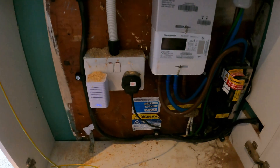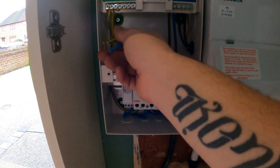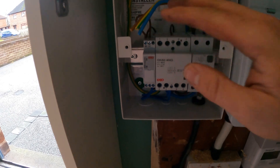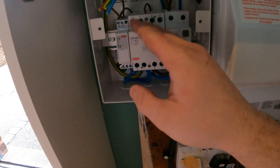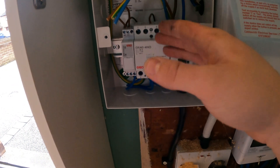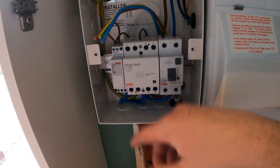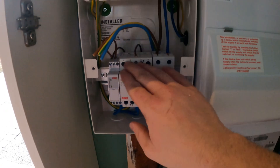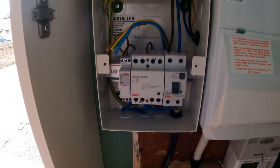I've cleated that cable up and round, we're in, we've connected up, moved that sleeve out. There's our feed for the car charger which will go into the top of this contactor — including the earth, which goes against everything you've always known, really. If there's a pen fault it's going to switch the earth off, but that's exactly why it does it: the earth is where that problem lies. You don't want that earth to become live during a fault on the incoming neutral. So all three conductors go into that contactor. If there's an issue it will turn off everything going to that car and be a lot safer.